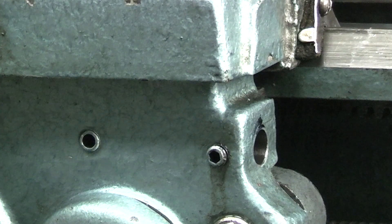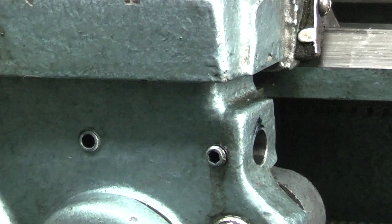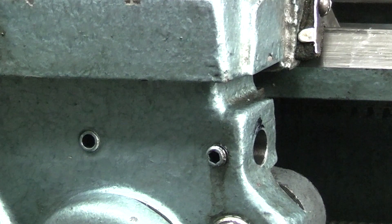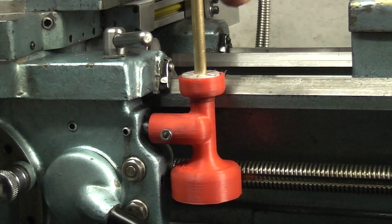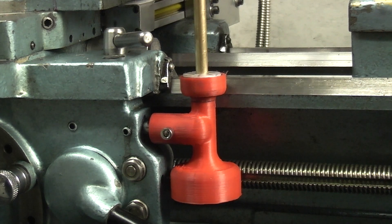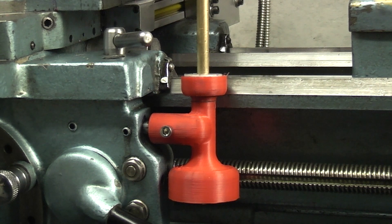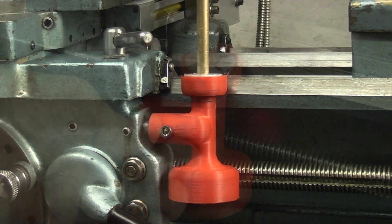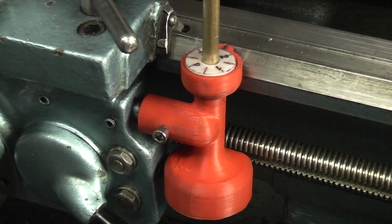On the saddle, it's this hole we use for the thread dial. On the front you have a grub screw and this is a three-eighths hole. If you haven't used it before you might need to put a reamer or clean out the dirt and paint from the hole, and you should find a three-eighths rod fits in the hole. The thread dial fits in this hole. I've left the brass bar full length for now — that is the finished thread dial. Pull it across to engage it in the lead screw and push it forward to disengage it.